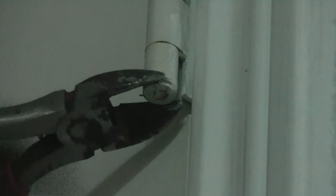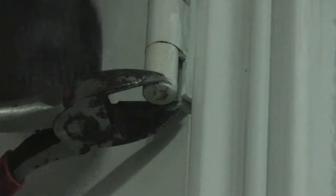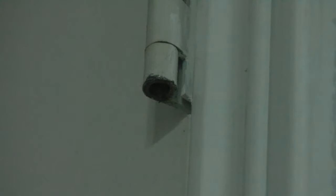I squeeze on it and just tap the hammer gently — it won't take much for these to pop out. I check it and I can see just a little hairline, so it's coming. I don't want to rush it. Squeeze on it again. Sometimes by just squeezing it will pop it right out if it's not glued too tightly with paint. So I tap it — and it popped right out. You get no marring on the edges. It's just like pushing in, squeezing, and pulling it out as you crimp it — just pop it loose.